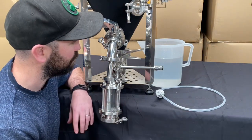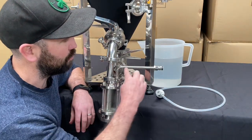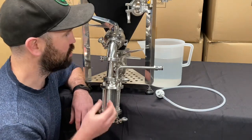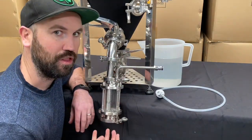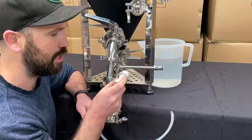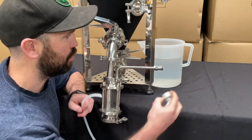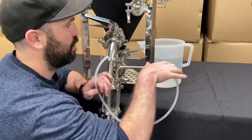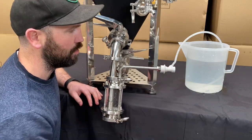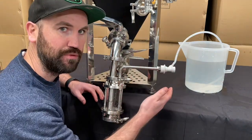When you're at your yeast dumping process, you don't want any oxygen in your beer at that point. This yeast brink, through this fallout valve here, is going to allow you to exhaust all the oxygen out as you dump the yeast. If this wasn't on here and you're opening up your valve, a lot of oxygen would be going up into the tank. All you're going to need is a ball lock gas fitting here — disconnect — and it's open-ended. We push it straight on there, and now we've got this set up ready for our yeast dumping, with the ball lock on the open-ended going into the water over there, so you'll see all the oxygen dispersing out of the yeast brink as we dump.